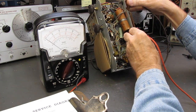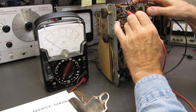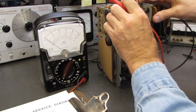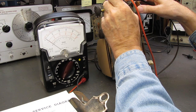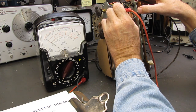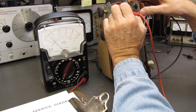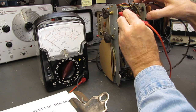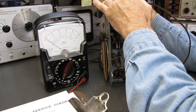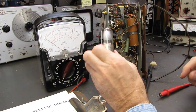From there, the wire runs up and over to here, which is our other 12SK7, pins 2. Where are we? Pin 1, 2. And pin 7. Uh-oh. There's our dead one. Pin 2, we have something. Pin 7, we have nothing. Oh, that's heartbreaking, because very likely this tube had a lot of life left in it.